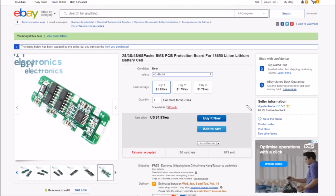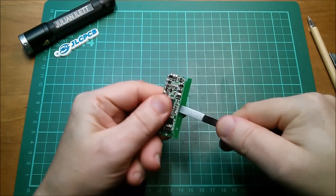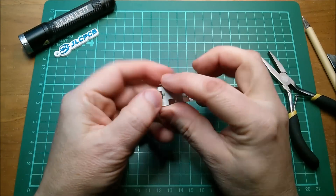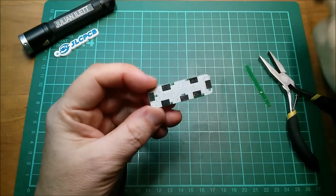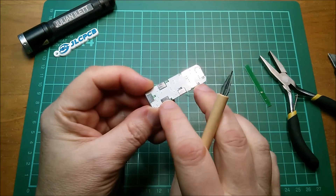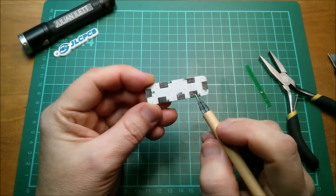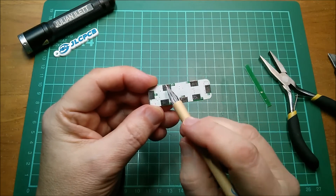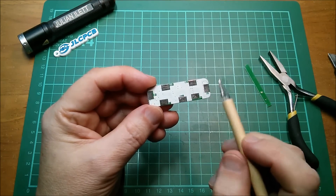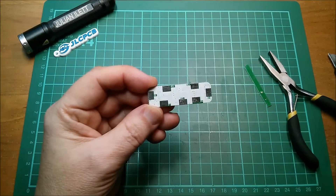Breaking off the panelizing bar — it's really quite small, but with big connections on the back. We've got P+ and P− — that's pack positive and negative, where you put your charge current in and pull discharge current out. Then we've got five terminals for the most negative of the four-cell pack and all the positives from there. That's quite nicely laid out.